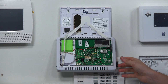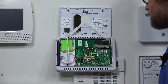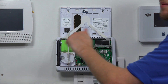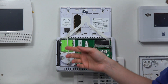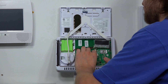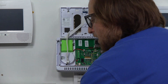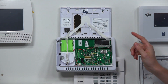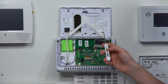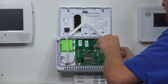I'm going to take off this side slot to show you that there is an antenna hiding inside — this is our communicator right here. We're actually going to have another antenna running through in the same spot, but I just wanted to show that for demonstration purposes. I'll take out the old antenna first to get it out of the way — you can see it runs through this little hole right here. Now we're going to take out our old communicator, which has two Phillips head screws.